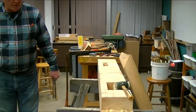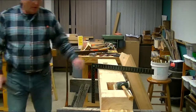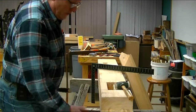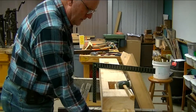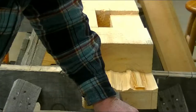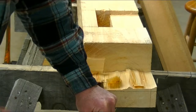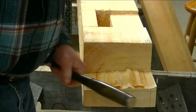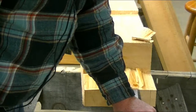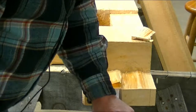I've done a lot of prep work in advance for this, so you won't see 100% of the work done, but hopefully we can get through this in our little presentation here. First thing I'm going to do is finish this particular joint — I've already done the backside. This is a tenon. I'll call it a simulated post, and what I'm really going to do is just harvest these pieces off here. I'm basically roughing down to my line because I use my square to lay out my lines. I'm just working my way across, taking the bulk of this material off, doing it quickly this way.